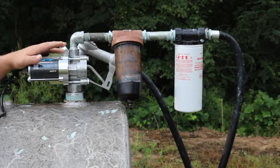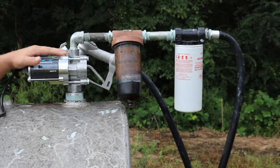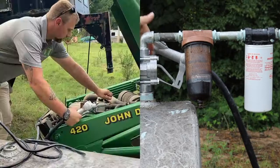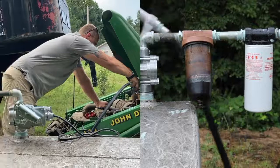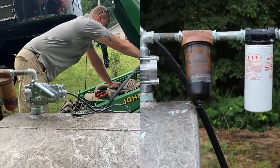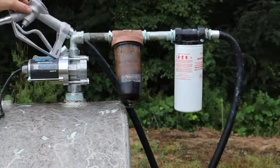I think this one does 12 gallons a minute. It runs for 15 minutes as the duty cycle, and then needs 30 minutes of rest time or you'll burn the pump up. It's a fairly simple operation — you plug the power in, there's an on-off switch, and when we pull our gas nozzle out, we just hit the lever just like we would at a gas pump. This is the gas valve that came with it, but it doesn't have an auto-stop when it gets full, so we are going to change that out and add a different gas valve.